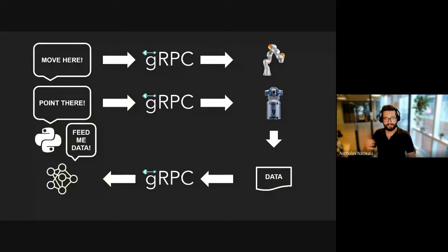And so that's why I love this architecture, because it brings the hardware into the loop. It's scalable, it's testable. Every time we want to add a new device, we just create a gRPC wrapper around it. And now all these devices become abstract servers that provide a set of callable functions to a client. I don't have to worry about all this weird connectivity. The client doesn't need to know what they are or how they're implemented. It makes it great for testing and mocking. And the hardware controllers don't need to know anything about the machine learning, data science, or the application. They just focus on being hardware, on being machines. They do what they do, they do their motions, and they just submit whatever data is done at the end of their motion session.